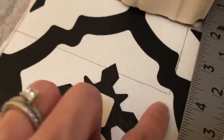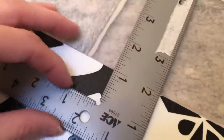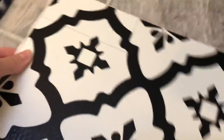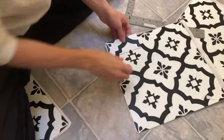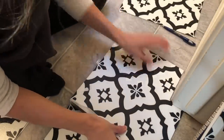This is the two-inch notch that had to be cut out of the tile so I could butt it up against that corner on the wall. Normally people will remove their baseboards while doing flooring; however, these baseboards in our bathroom were really old and we plan on replacing them anyway. The new baseboards will be a little bit thicker, so a tiny gap wasn't a big deal. Making the cuts on the tiles was a little tedious and does get a little sticky, but I'd say go slow rather than fast — it worked easier for me that way.